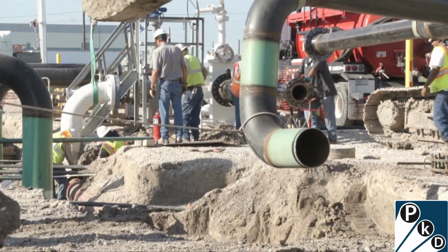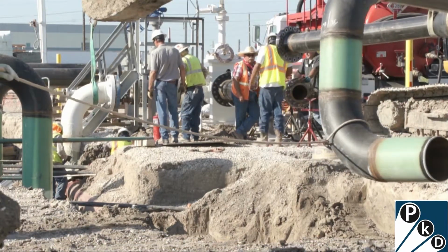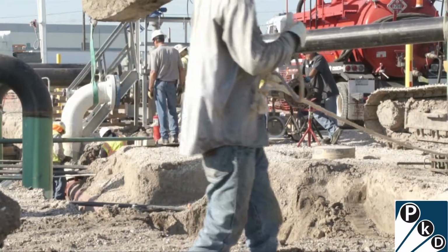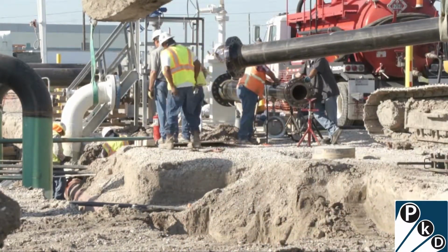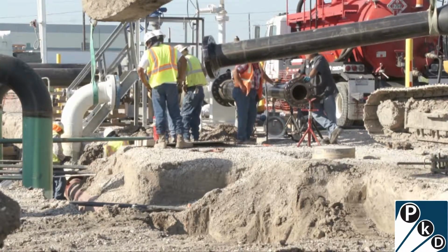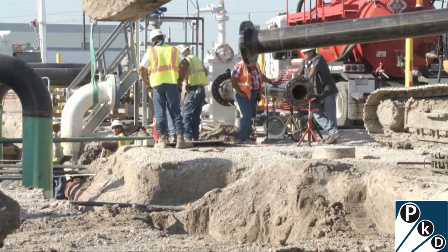In this video clip, these guys are cold cutting a piece of pipe. If you see there, we've got the white pipe that's being held by a strap to the backhoe bucket. And there's some people working down in the ditch, and you can see they are turning basically a collar, which has got some cutting wheels on it. So what we're going to do, we're cold cutting it.